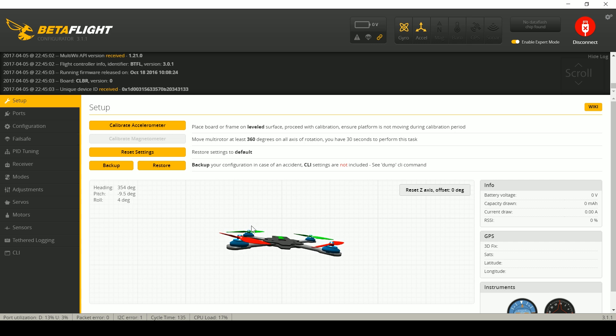I'm assuming none of the other things are wrong. Now, if your quadcopter is level but it doesn't appear level on the model, then what you need to do is level the quadcopter out and hit 'Calibrate Accelerometer' with the quadcopter flat on the table. That will recalibrate your accelerometer. Sometimes the accelerometer can get miscalibrated just from getting whacked or thumped. Sometimes when you upgrade your firmware, the quadcopter will be miscalibrated. If at any time the copter won't arm — you set it flat on the table but the 3D model looks tilted — then you need to calibrate your accelerometer.